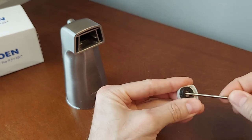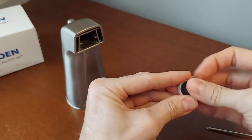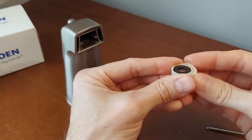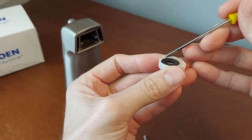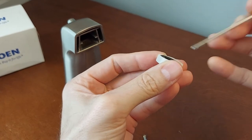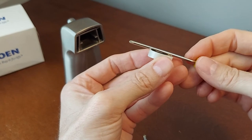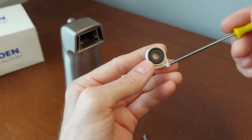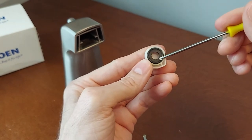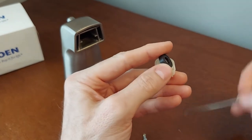So what you've got is this little part here and this is the thing that makes a lot of trouble for everybody. If you simply pull it out, you can see what the problem is — see how there's a space right here. That's not sealing well when it comes up against the spout. These things wear out, they kind of shrink and get dried out — this washer is the biggest problem.